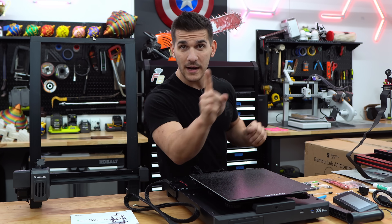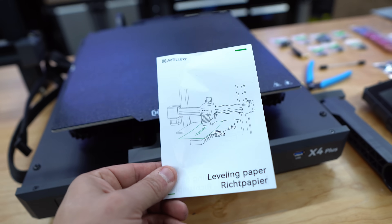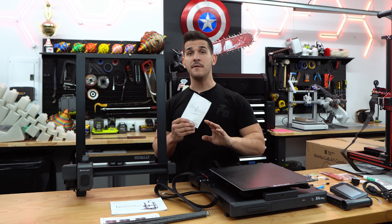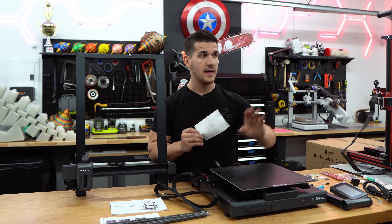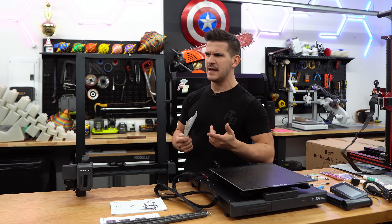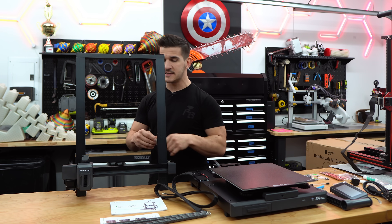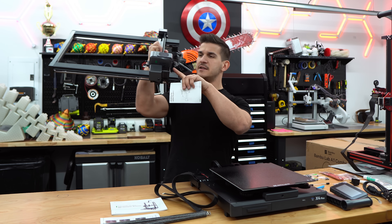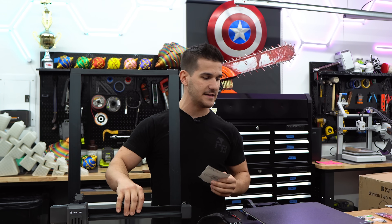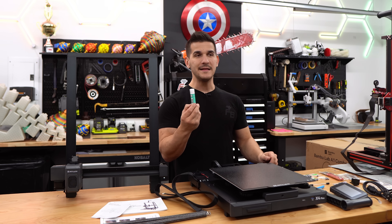What I do not like already — a leveling paper. It's 2024, why? This should be gone. I think we are well past the realm of needing to manually level anything at all. The K1s, K1Cs, the Bambus — even some of the Neptunes — I don't think I even had to do that on my Neptune 4 Max. We're going to see what the leveling system looks like when we boot it up. It does have an inductive sensor, which should be okay, but I don't love inductive sensors based on my own history with them.